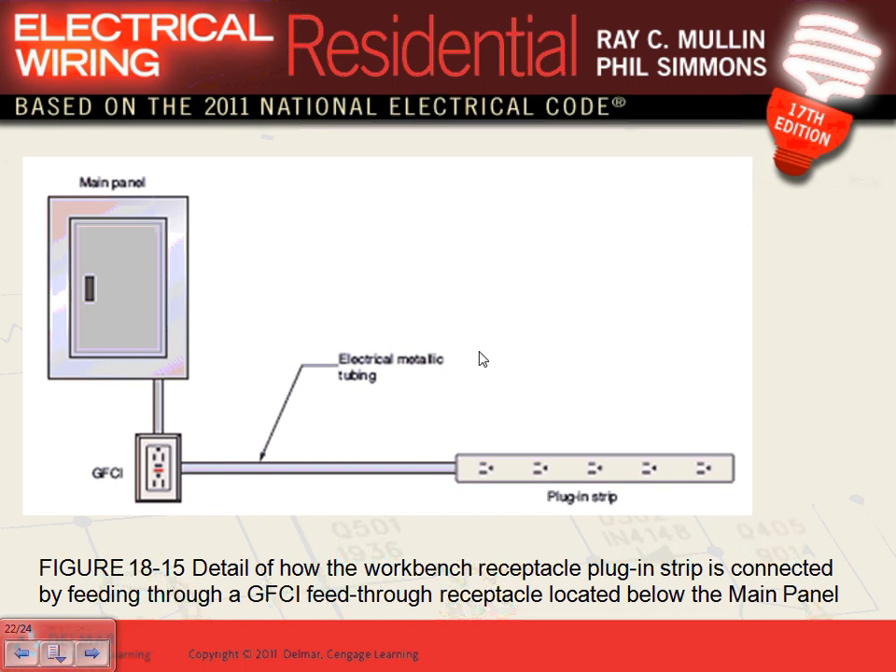When I teach wiring, there are close to 50 ways of wiring things. You as the professional pick the right wiring method for the location. You wouldn't do the whole house with multi-outlet assembly — it's expensive and impractical. You'd use it on a bench. Some people use them in a kitchen — in the countertop — but they have to be GFCI protected.